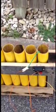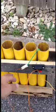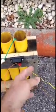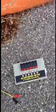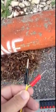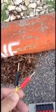Here's the finished setup. You've got your igniter attached to your fuse, your igniter plugged into your speaker terminal, and your shooting wire can be as long as you want. Carry it out to your field module. Speaker pins are soldered to your shooting wire, and there are your speaker pins plugged into your field module.